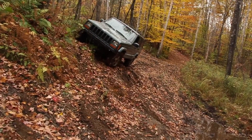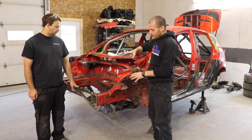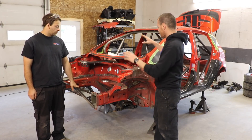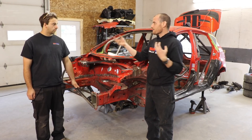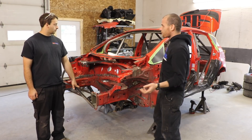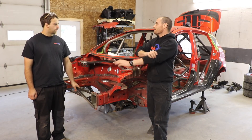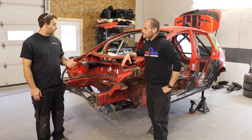But you can hear the whole chassis creaking, which is something that would worry me — if I were going to seam weld this car, when you heat different metals and cool them at different rates, if I started seam welding at the front and went all the way to the back of the car, what might happen? Yeah, you could actually twist the shell from welding on it.